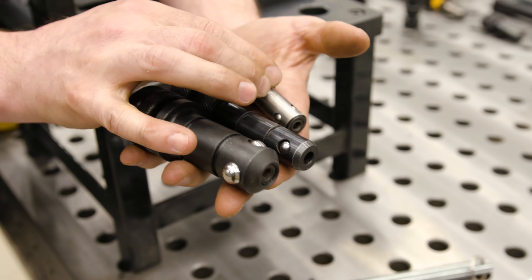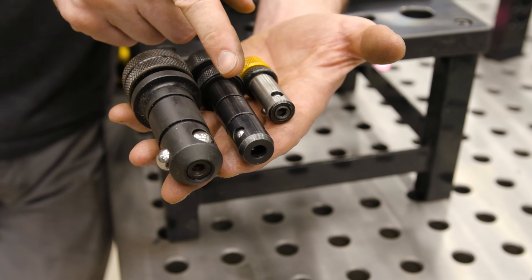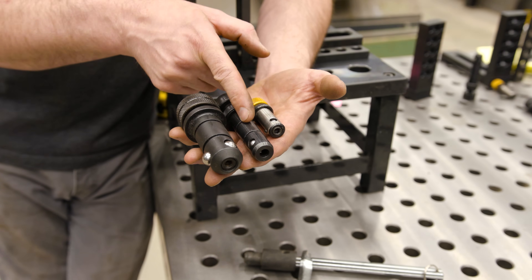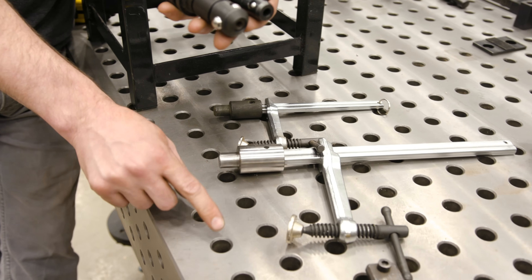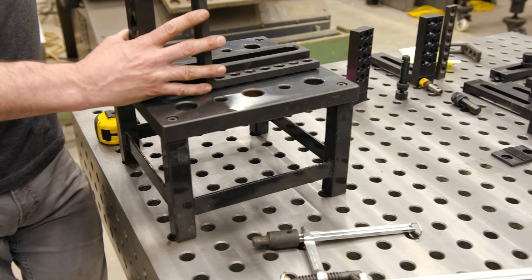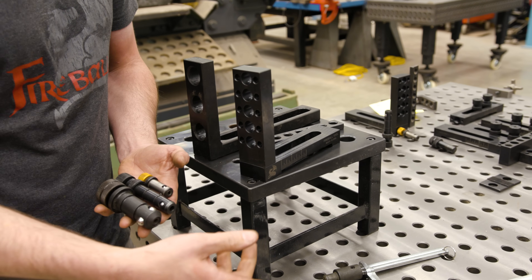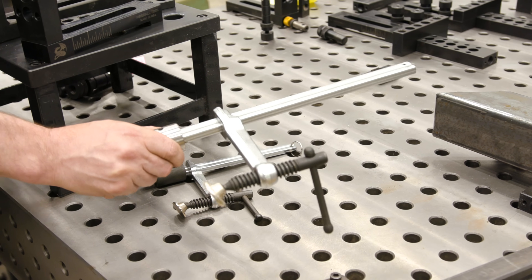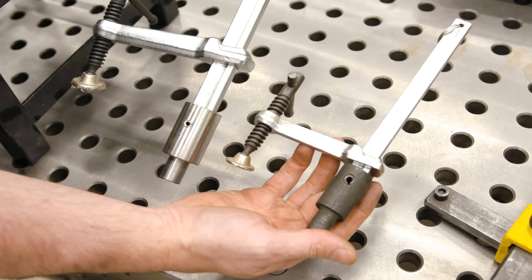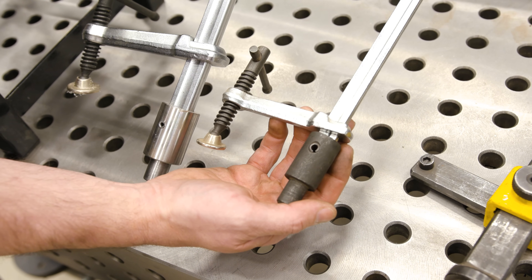As you can see when I fit it in my hand, it looks appropriate — it looks like it can do the best of both worlds. This has a cross-sectional area 50 percent larger than the 5/8, and it's quite a bit smaller in diameter than the 28, but what I can do with this bolt is put it on the 2-inch grid pattern. So I get a better resolution of holes, which means more opportunities for clamps, and I get the extra strength to make heavy-duty fixtures — with a much bigger clamp for extra clamping force but not overly excessive. It's really the Goldilocks of size — it slots perfectly in between for the person who can't decide which table system to go with or doesn't know which projects they'll be doing in the future.